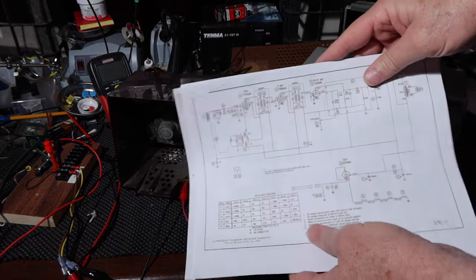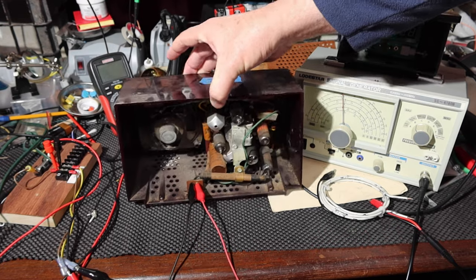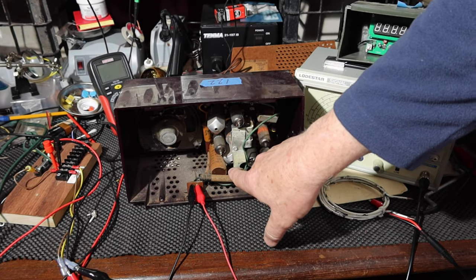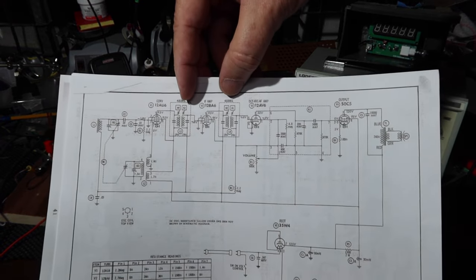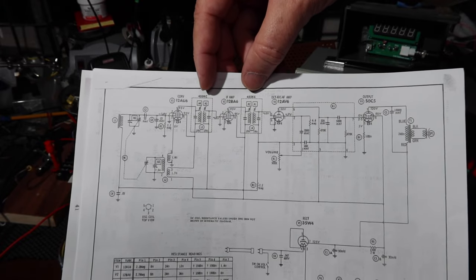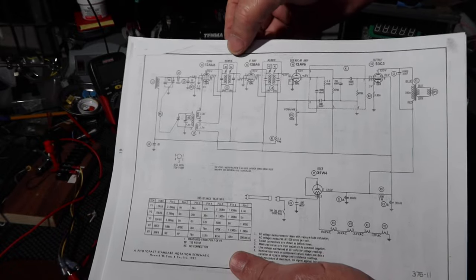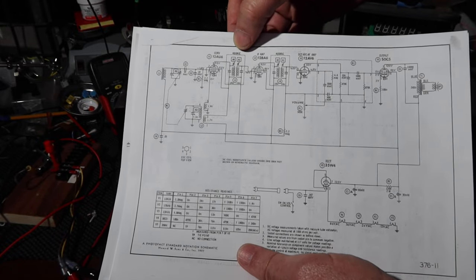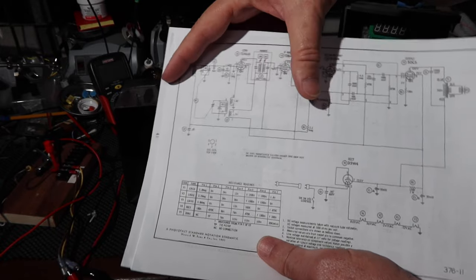And I was noticing maybe it wasn't really clear about a couple of things I made a comment about. So this thing right here, there's one here and there's another one right down here. We call those the IF transformers. That's these two boxes you see in dotted lines. So these are like bandpass filters. They're set up, and imagine a bell curve kind of thing, to allow frequencies centered around 455 kilocycles to get through, and it blocks the ones that are not on that frequency, further away.